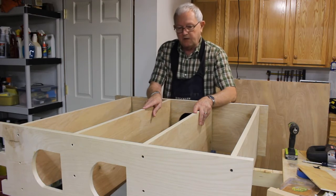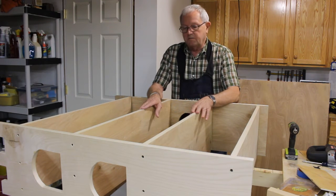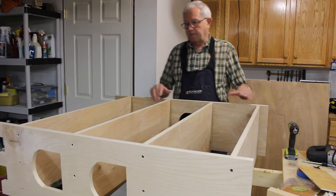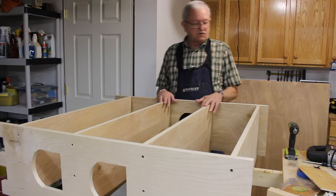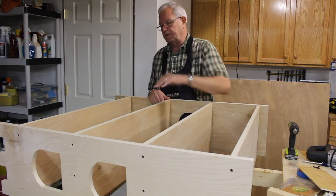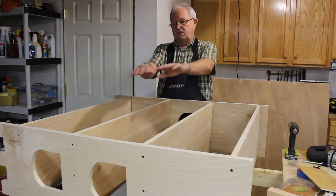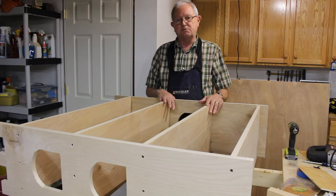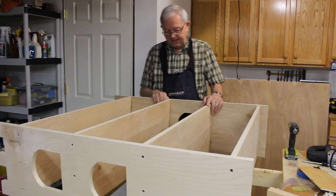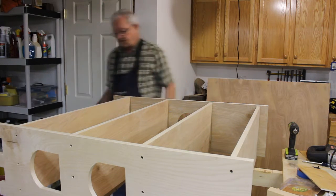What I'm doing now is I'm putting together the main carcass of the bookcase and it's just temporary — I haven't glued anything. All I'm doing is fitting the shelves to the sides and putting them in with screws. After it's together, I'll cut and fit the bottom skirt, the dividers that go between the shelves, and the trim that goes on the top. It's just a matter of getting the dados so exact that it takes a little tweaking to get the shelves to fit in their place.